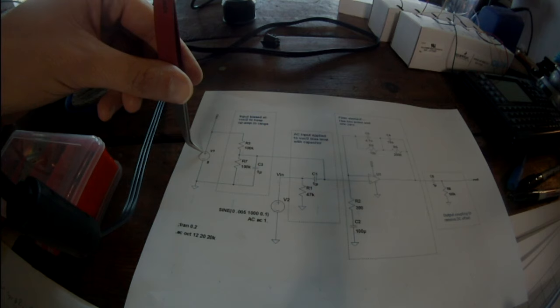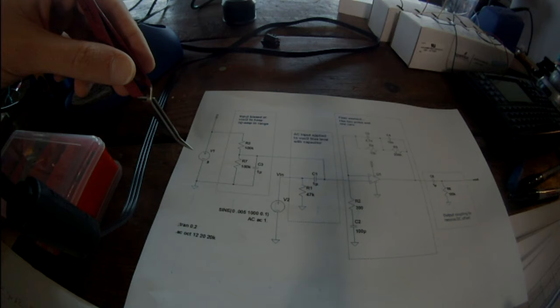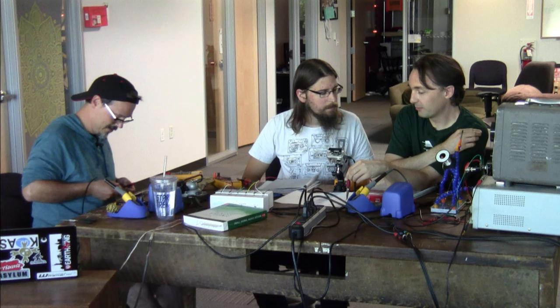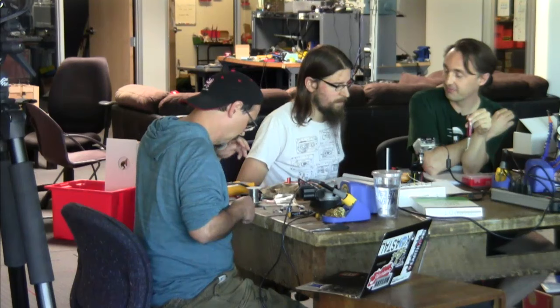What is it, about 500? It was specified 500 millivolts? No, it's like 200 millivolts? 10 millivolts. Okay, so it goes positive 10 millivolts, then negative 10 millivolts. So we can't go below negative. We can't go below negative, but we can AC couple the signal through the amplifier, that we can add a DC offset to it. So that rather than being plus minus 10 millivolts, if we were on a 12-volt rail, we could be at 6.01 and 5.98.